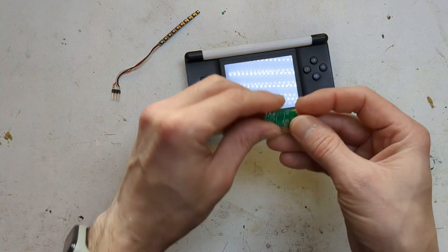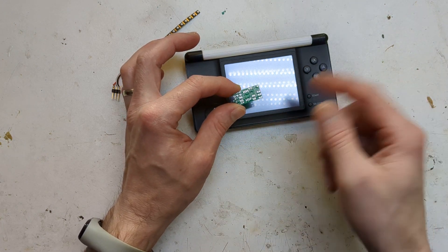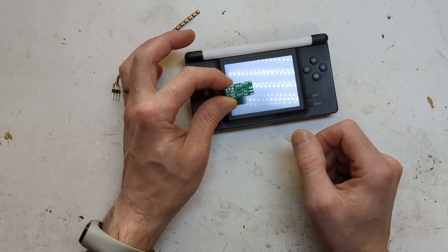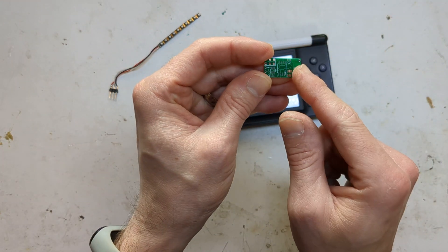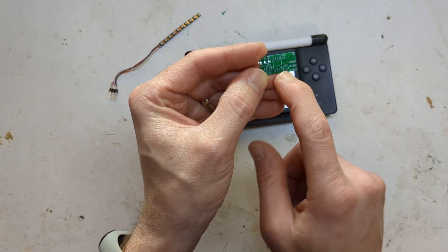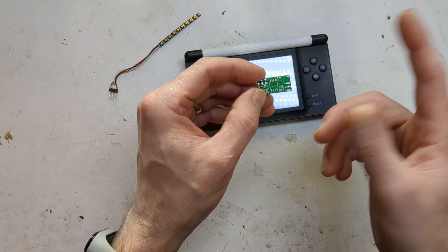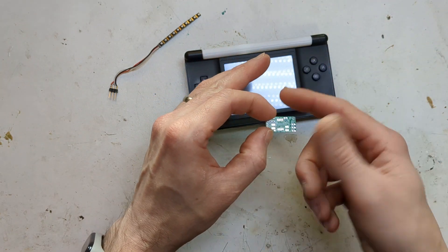So it kind of didn't work out. In the end I actually used the touch sense chip from the Game Boy Camera, hooked up to one of the pins on the ATtiny85, and used that as the actual sensing, which worked quite well. I'm probably going to do a re-spin of the board because this still has the old chip on it. I also had to use the chip in a non-latching mode — in the Game Boy Camera one I used it in latching mode, so it's on or off — but this is where whilst you're touching it, it senses it, and when you're not, it doesn't.